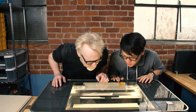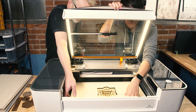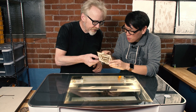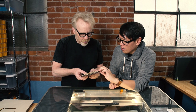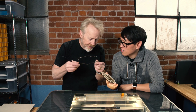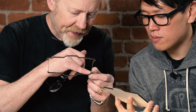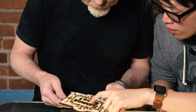It's done - took about 40 minutes, and most of that was the etching. Let's take a look. Let's take the material out - cut all the way through, no problem. There you go - that is a very deep etch. Oh, look at that! Because you drew the outline so bold and we marked it as a cut, it also marked it as an outline for that cut, so you have a nice little frame for it. That's not insignificant - that's like 20 thou. Really nice fine detail work. You can see where you drew in the center it's perfect.